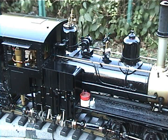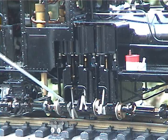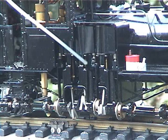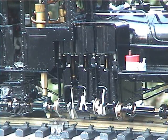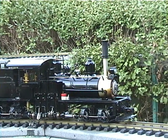If you're running, say, in the 40s or close to freezing, you're going to expect shorter run times and less power. Also, while we're waiting for steam pressure to build, we can oil the drive line up. And of course, we have to clear the condensation out of the cylinders.